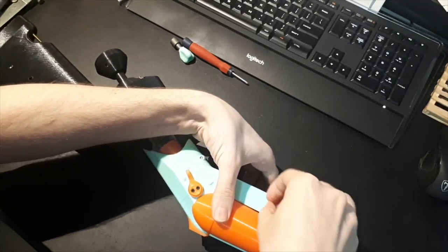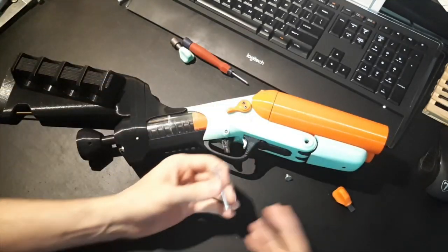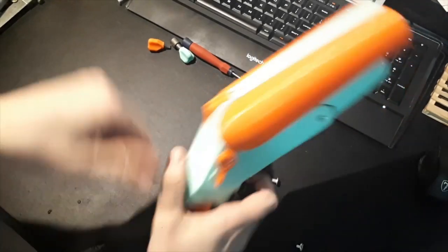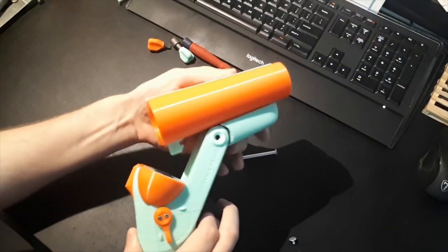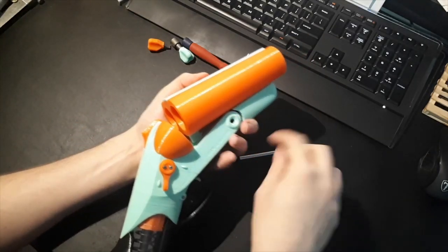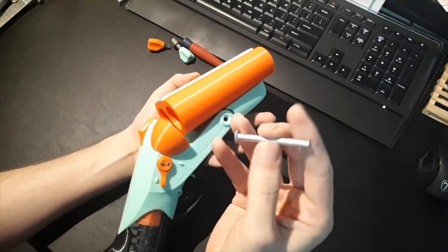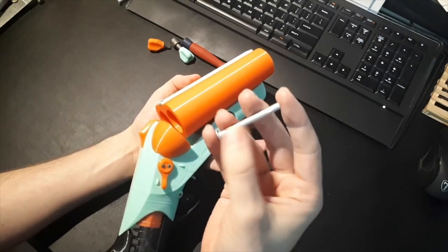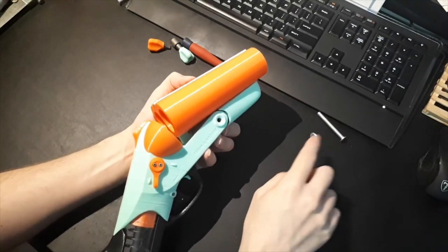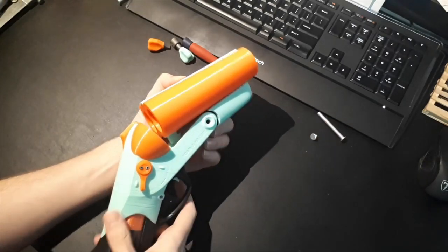The reason I'm using a Chicago bolt instead of a threaded rod or nut is I'm worried that over time the blaster will erode the plastic from being rotated on threads. The Chicago bolt is completely smooth, so I don't have to worry about the printed parts wearing down rubbing against it. That's why I would suggest this style of pin over anything else.